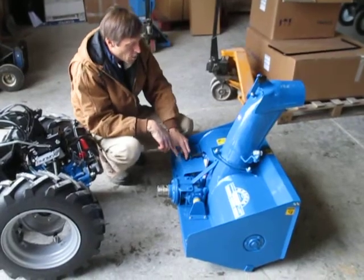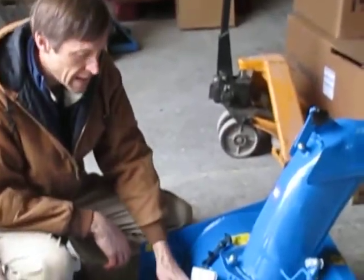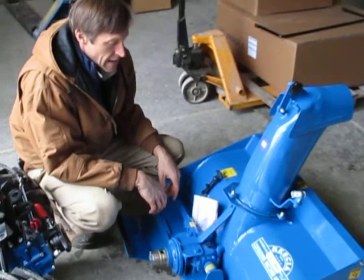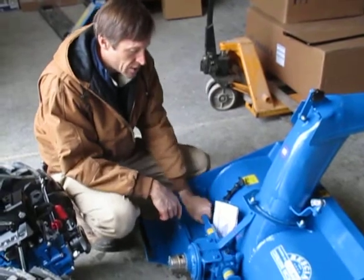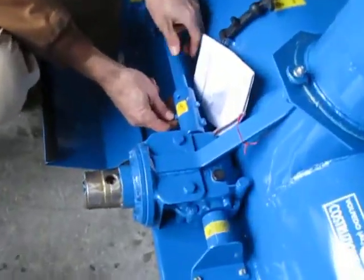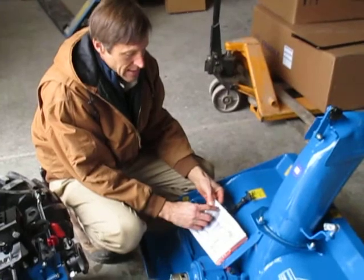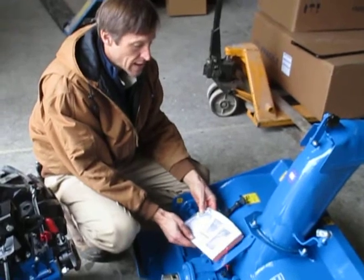This cover is something that you're going to be taking open occasionally — there's a little rubber strap here and this thing opens up. This is your shear bolt right here. If you've got a rock or the Chicago Tribune or whatever stuck in this thing because it was buried under the snow, instead of destroying gears or bearings or anything in the tractor, you're going to break a shear bolt. The shear bolt is located right here — it's a bolt that passes through the shaft with a nut on the other side. In with the owner's manual, you're going to find a couple spare shear bolts. This is a standard 6mm bolt and nut you can buy at any hardware store, so it's not some special thing you have to get from us.